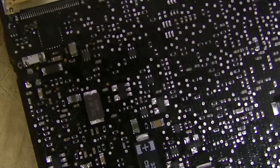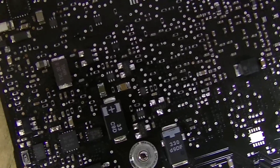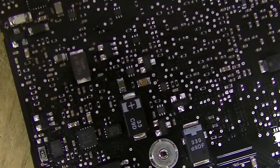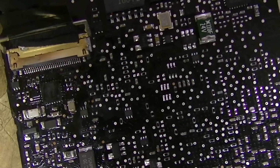Actually, I couldn't find one right away, so I used a 3-volt power supply I had lying around with a wire, and as soon as I put the wire there, the thing turned on. Anyway, I finally found the 301 kilohm resistor, put it there, and now — look — it's the most beautiful thing in the world. If you're doing data recovery, that's the worst thing in the world, but from a board repair standpoint, that's a really cool thing to see. And it works.